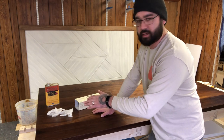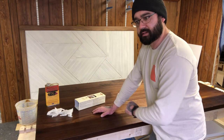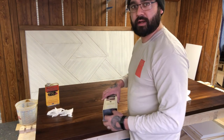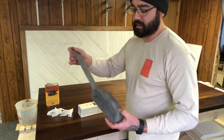The first coat I'll put on with a chip brush so I can get a nice build-up — maybe two coats that way — put a heavy coat on so the first couple layers are nice and thick. Then from there I'll sand through to 320 or 220, and from there I'll start burnishing with steel wool. That stuff lasts a long time.